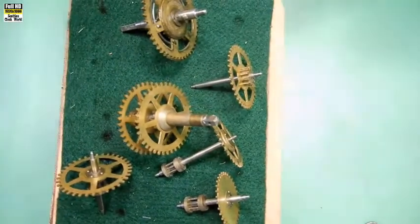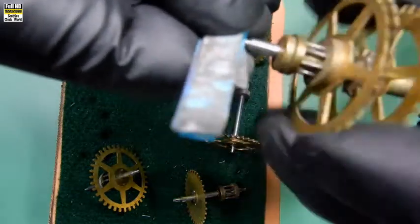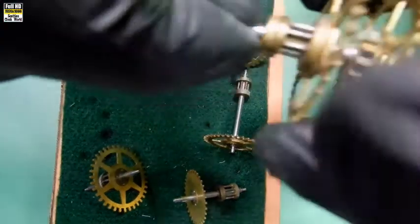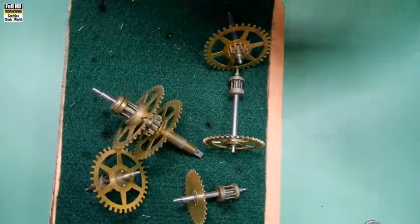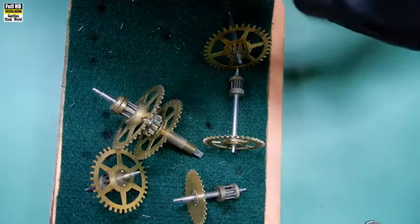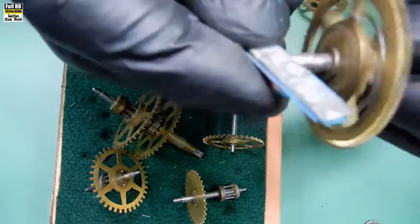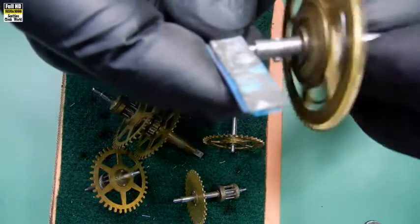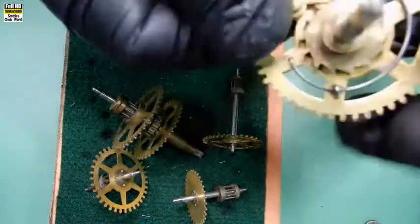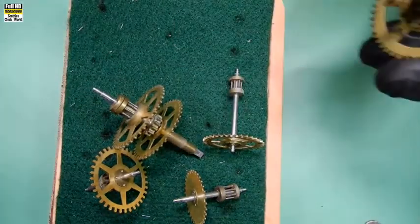There are our clean wheels, and what we'll do now is, using a popsicle stick with 2000 mesh paper on it, we'll quickly run over the pivot on each end of each wheel to make sure that they're smooth and polished. I've already run over them with my thumbnail and there are no deep grooves in them, so a light polish with this popsicle stick will remove any high spots on the pivots. If anyone's interested in how to make one of these popsicle stick pivot polishes, leave a comment below and I will make one and upload it. The key winding arbor seems to be quite square in each direction - it's not bowed over, so I won't need to square that off.